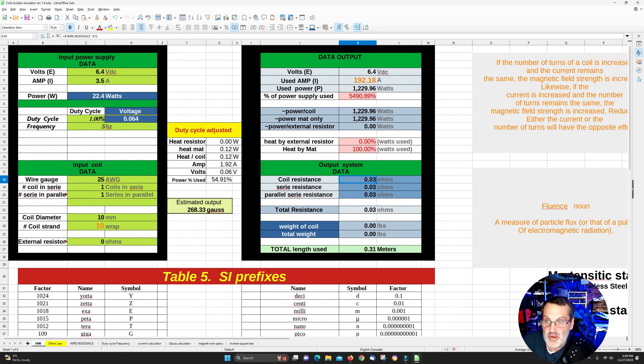I'm looking at about 8.5 to 8.6 ohms. So I'm going to cheat — you could enter it directly right here if you want, but so we don't mess up with the formula, I'll just put 100 and 100. Enter — so it gives me 3.2. Let's go 200 — 6.6. Let's go 300 — 9.9. So let's go 250 — 8.3. 275, 260 — there you go, 260 is pretty close. And now we're going to put four of them in parallel with one another, and that gives me 84. So I'm still within my battery power and I can go with four in parallel — that would be perfect.